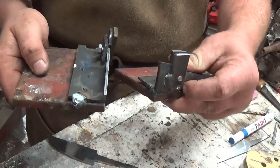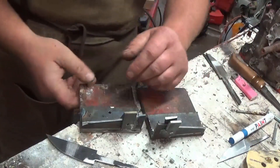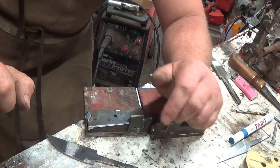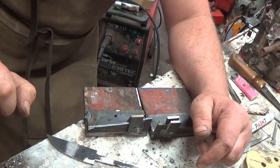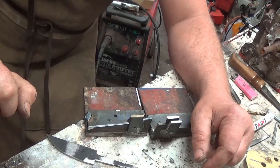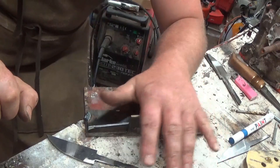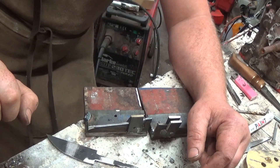These are matching so that you can turn the blade. In practice, if I'm making a batch of knives, I'll have one blade in each jig, then I can get one blade hot and ground, throw it in a bucket of water, work on the other one, then switch them and work on the other side. Then obviously take the blades out, swap the blades around in the jigs. Why don't I show you doing that now?